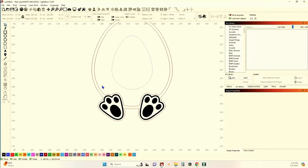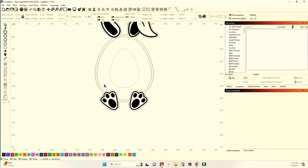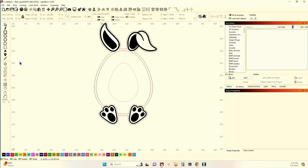Now, this is where you start having fun. Where do you place the shelf for that to sit on? And how do you make the notches for this to snap into? Well, we know we're working with 3mm wood. So I'm going to draw out what will be a toolpath. Put it on a toolpath. Tell it to be, well, it is 3mm. And then I'm going to come over here and tell it to go to the center of this toolpath, because these were all offsets of that original piece.